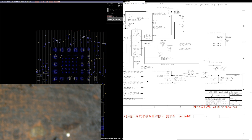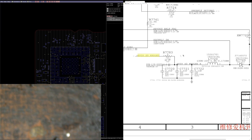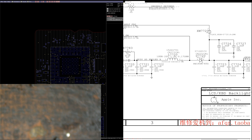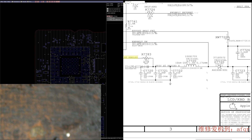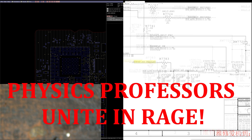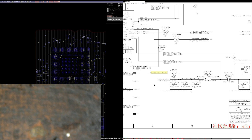The way a DC-to-DC boost circuit works — long story short — if you want to turn five volts into 25 volts, you send five volts before a coil. The coil is going to store voltage in it. After the coil, we short it to ground. This is like stopping short in a car: if you're driving at 20 miles an hour and stop short, for that quick moment you jolt forward faster than 20 mph. Same thing happens to the electrons — it's just stopping short over and over again.